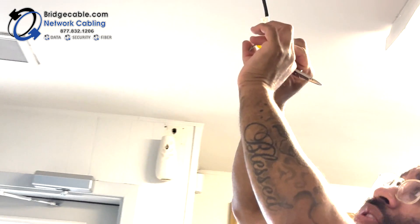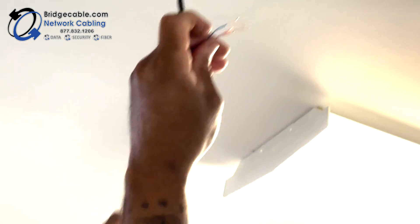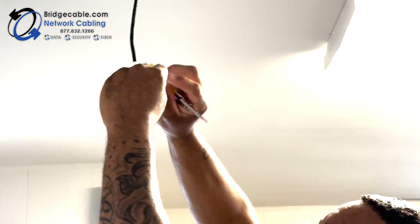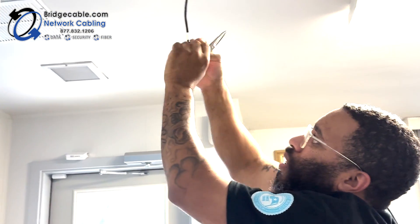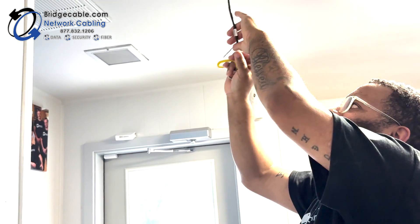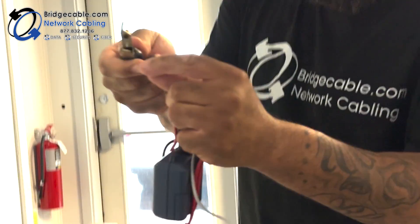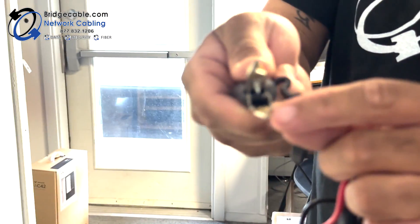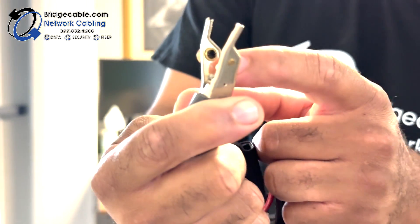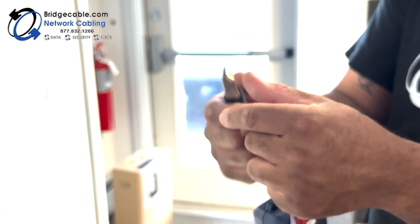For the red, I'll put four wires together. For the black, I'll put four wires together. Once I get all four like that, I'm going to twist them together so that way they're all connected. You could do one single one, but it's not going to be as loud as if you combine four of them together. If you open these up, this little circle there is typically where you want to connect. These teeth in here will allow it to make contact.